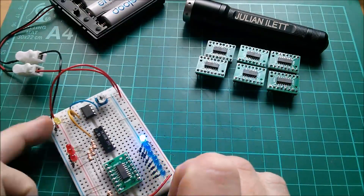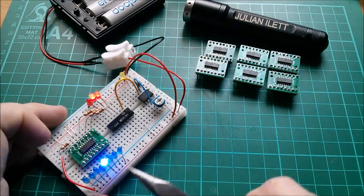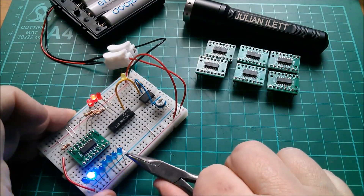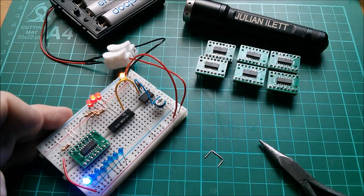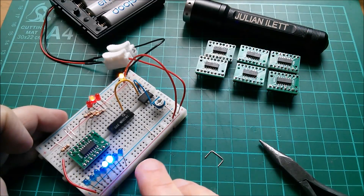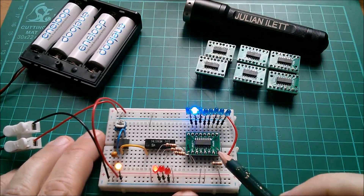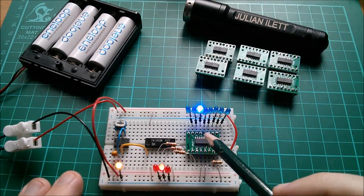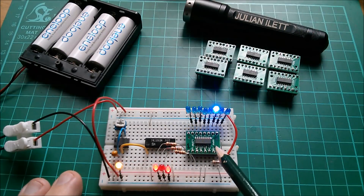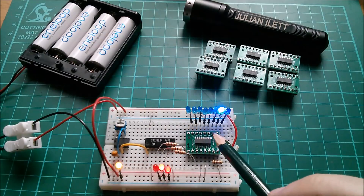I wanted to fit this eighth diode because originally its output is on the other side of the chip. While moving the VCC link, I took it out and the circuit still worked, which surprised me a little — but it shouldn't, because we've seen this before. Dave Jones has done a piece on microcontrollers that still work with no VCC. What if, because I reversed ground and VCC, the only part of the chip that burnt out was the internal link to the VCC pin? This chip runs with no VCC connection because of the ESD protection diode.